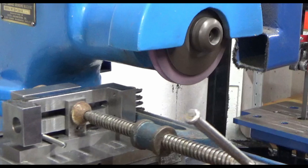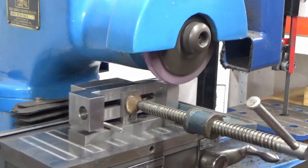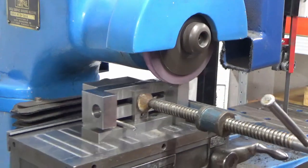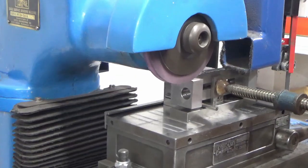I've checked the 1-2-3 block on my surface plate against my granite square - if you want to see that, go back in my catalogue and look at one of my tips videos about measuring squareness where I actually measure these 1-2-3 blocks. So I know they're really square. We've got the part clamped to the 1-2-3 block with a parallel to bring the height of the side of the vice above the height of the block, and we've then got two dowel pins sat on that parallel. The reason for that is any material with a carbon content will transfer magnetism to the component. If I just sat the part on top of a parallel there's every chance it would influence itself down to the parallel rather than back to the 1-2-3 block, even though I'm clamping it. The two dowel pins stop any chance of that happening.